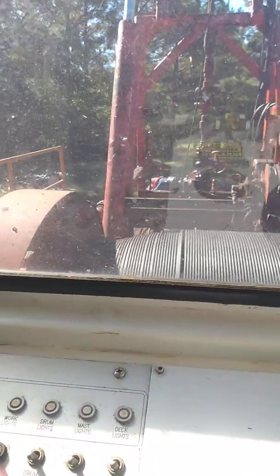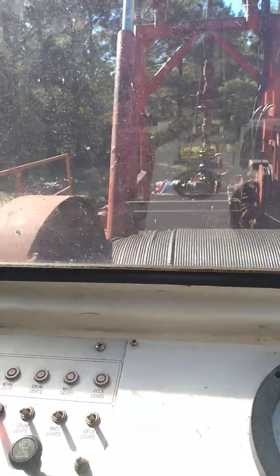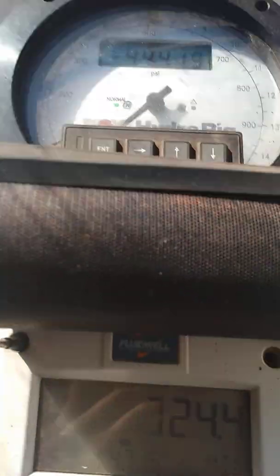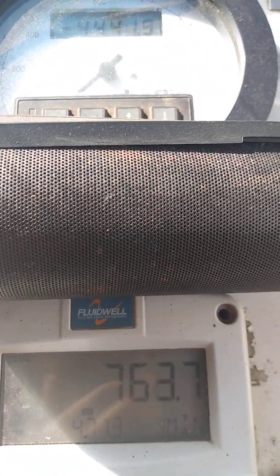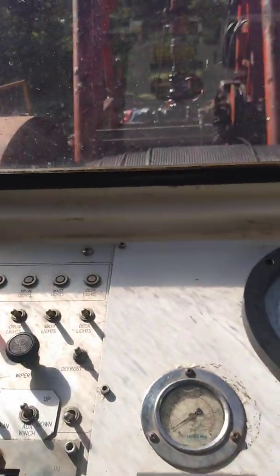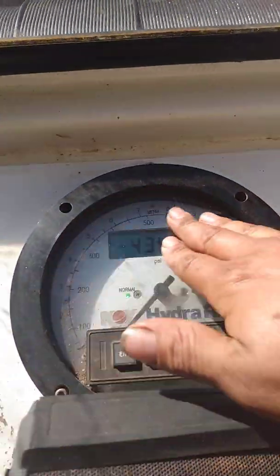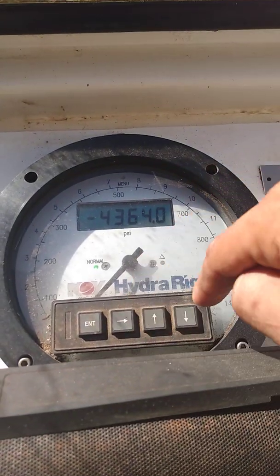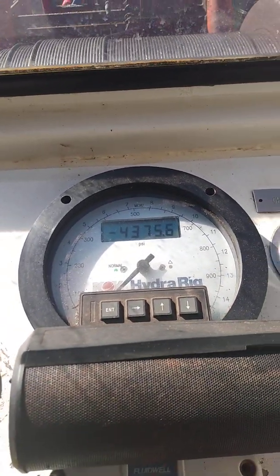How my line spools up, that's a whole different story. I'm going in at about 494 feet per minute, and this is how to swab without your weight indicator. My weight indicator is way off — I even adjusted it and it still messes up throughout the day, so I don't even worry about it anymore. I'll get it fixed eventually.